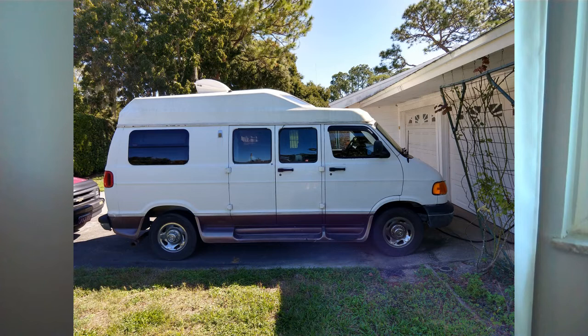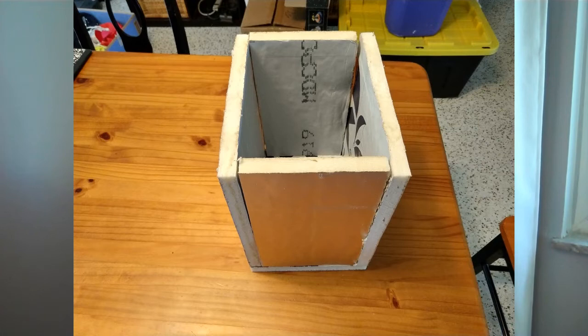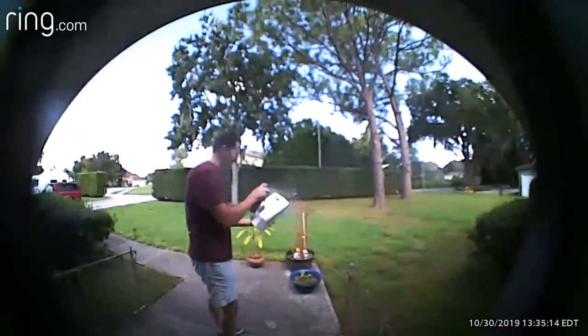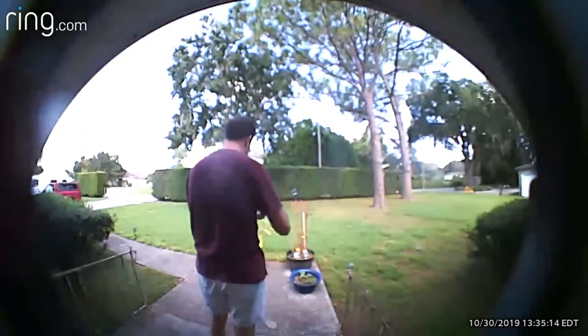The idea here is just to store some meats and cheeses for a camper. I put a lot of insulation in here — I had to use poly-iso insulation, which is the best foam insulation I can buy, but I had to use three-quarter-inch thick sheets because I'm in Florida and that's the thickest sheet locally stocked. Ideally I would have liked two-inch thick sheets. To attach the poly-iso to the aluminum flashing, I'm using Super 77 spray contact adhesive — you spray it on both parts, wait 30 seconds, stick it together, and it bonds aggressively.